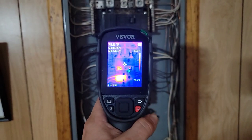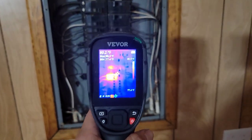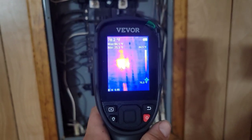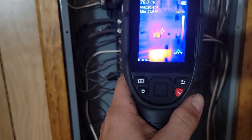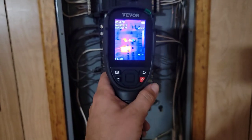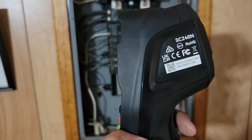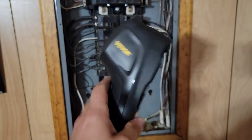This is a thermal imaging camera, and I'm looking at a hot spot inside this box. The hot spot is that breaker we just replaced. This is a really cool tool you can use to check out electrical boxes and find out if you have issues inside the box. It looks like we've got a couple of different issues — we've got that lug right there that's an issue and may be loose, and then we've got this breaker. So we've still got some problems. This is a SC240N — it's around $300. Link in the description.